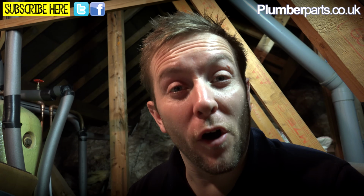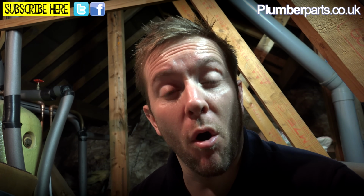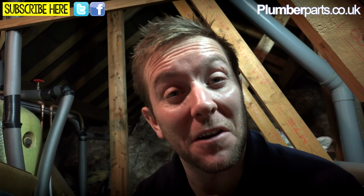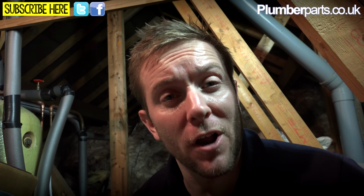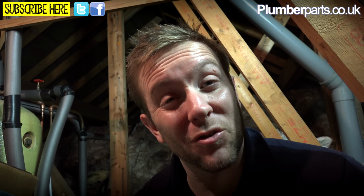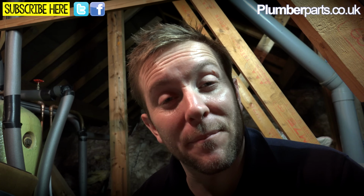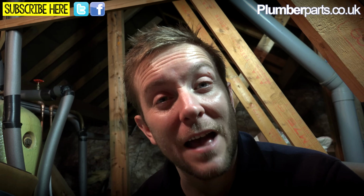So here we are up in the loft, and basically this is where it's all going to happen. Because there's a problem with low hot water pressure here, I said to Paul, who is my lovely customer, who cooks me great food in the Big Green Egg, this could work or it might not work because the head pressure could be too low. I've had a look at the system and we do actually have a head pressure of 3 meters. So that's all right, I've checked that, I'm happy. But the thing is, you need an adequate flow of water through your single impeller pump to open up the flap, basically, and start turning the pump on and getting nice, hot, high pressure water. So let's have a quick look.